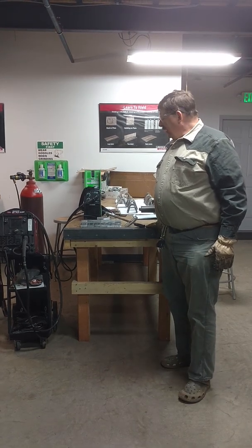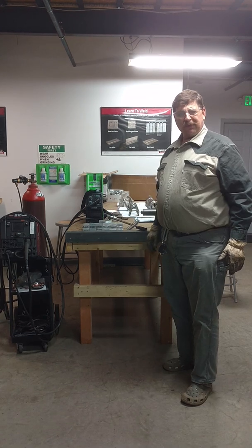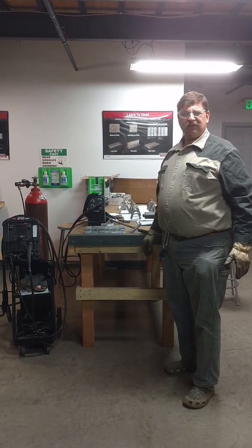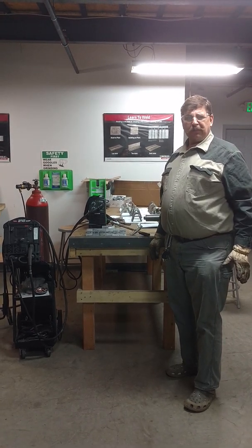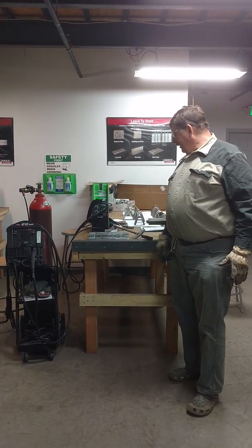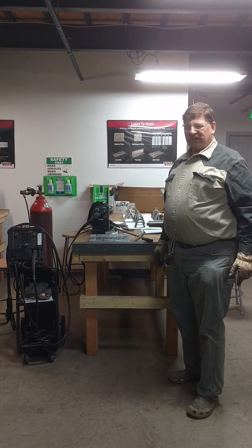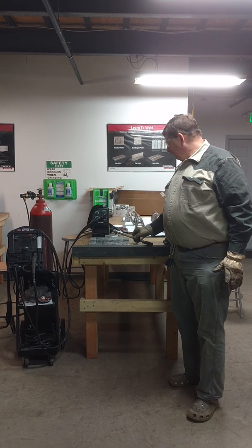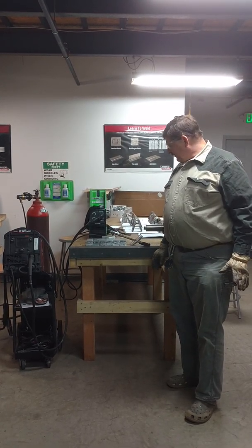At Maryland Welding Technology, I've had this question for years about the quality of the weld metal produced by the various flux core wires. I've been forced to use these in the sheet metal industry over the years with varying results — some producing very brittle metal that broke at the slightest flex, to metals that have performed just as well as any MIG weld. So I decided today to take a sampling of all the various flux core wires I could find and submit them to destructive testing.